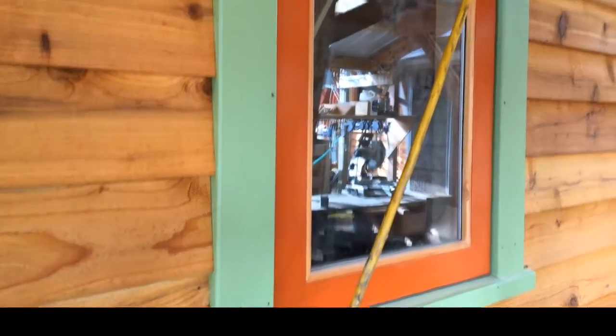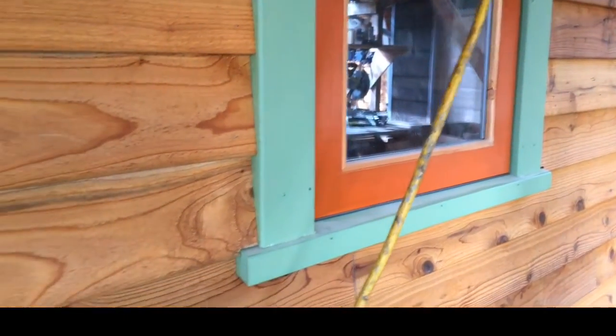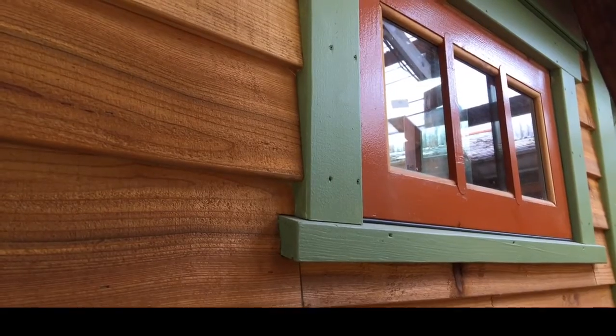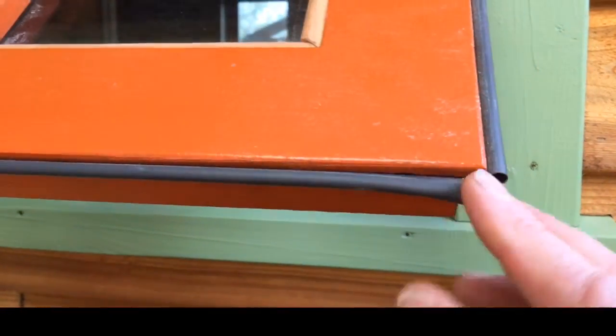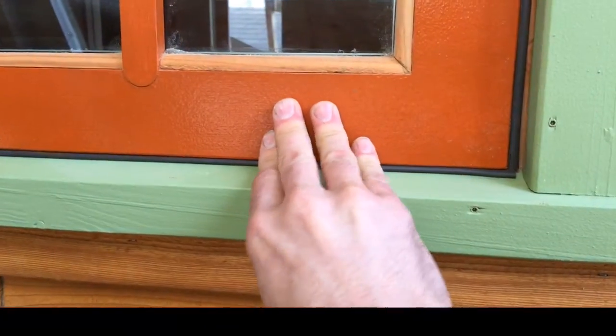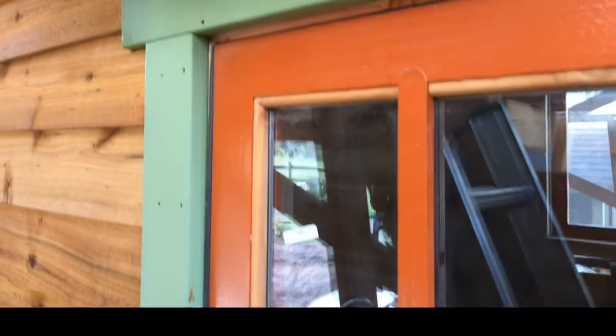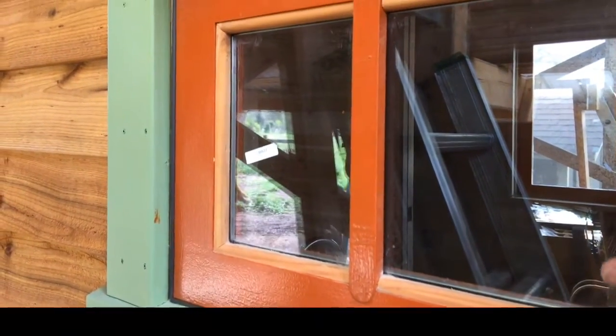Let's look at a window. Here's a casement window with a surface divider that I built. This is the fuchsia house — it's a new design by me. There's a little tiny kitchen window. It's an awning window, which means it opens outward, which is really cool. I use a modern design on my windows and put kerf-in weatherstripping in the edge of the window. It creates a kind of a wipe seal when the window is shut all the way, and that prevents water from entering in the sash area. This has insulated glass. Right now I'm using all insulated low-e glass in my designs — it's really nice technology to have these days.